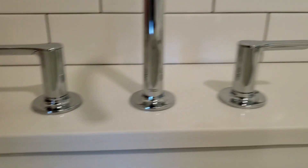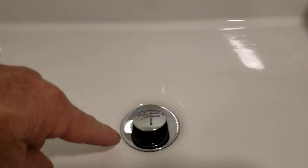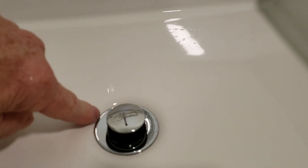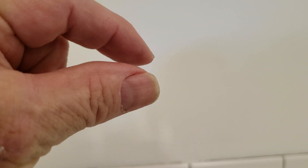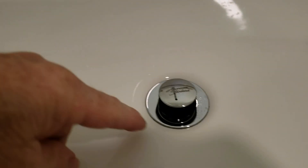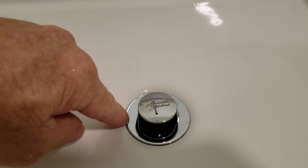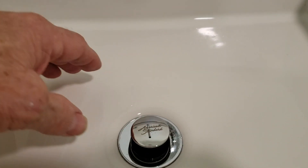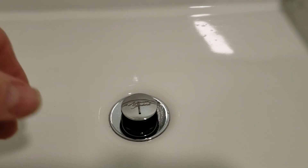Nice-looking faucet with good flow, but a little fussy with the drain assembly. This one was leaking — they came with some white foam that goes in there, but this sink is a little deformed. The foam is supposed to create a constant slope around the edge of the seal, but it was hitting in some spots and leaving a gap on the sides.